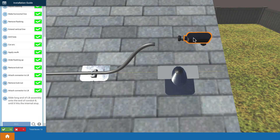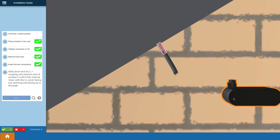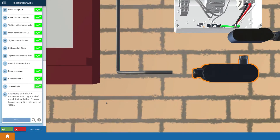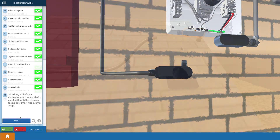In all of our electrical installation work, we talk a lot about using conduit bodies — LBs and LRs and stuff like that. We connect them into our conduit to help us make these 90-degree turns where you're going to use them for wire pulling. Let's take a minute and talk about these conduit bodies.